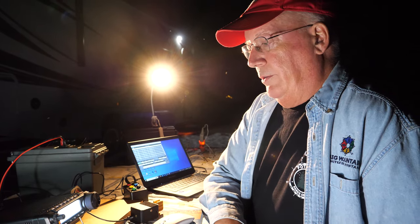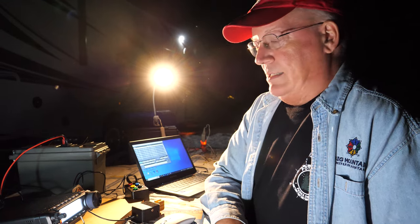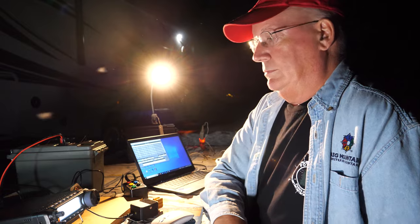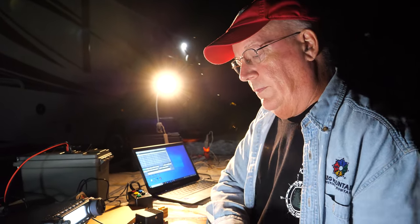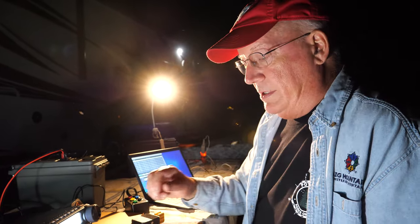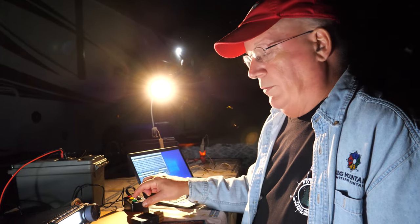In fact, last night we had thunderstorms in the area, so that noise was like plus nine last night. We're not getting any callbacks, but we are getting spotted on the reverse beacon network. K9IM has got us at 12 dB above the noise floor, so we are getting out.